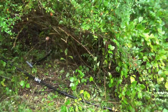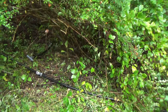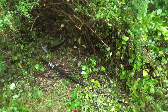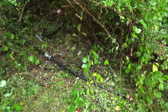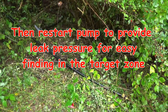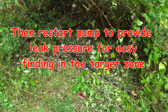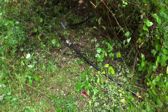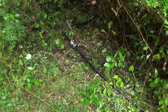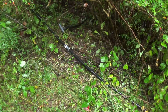That's why shutting the valve off, pumping pressure up, then shutting the pump off and waiting to see what pressure it bleeds back to is such a useful tactic. That tells you how much standing vertical column of water you have, which gives you the elevation to target. It's an easy way to find and target a leak so you can fix it. Hope this helps — don't forget to like and subscribe, and feel free to leave comments, questions, or suggestions. Thanks for watching the Pharmacy Seeds Network.